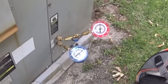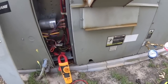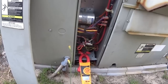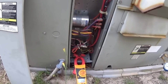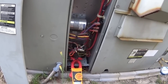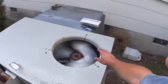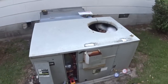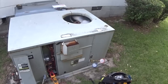About 215 over 75. So the refrigerant charge is fine. We've got 13.6 amps. While running, capacitors checked good without a load anyway. We're not doing too shabby, I suppose. Got pretty good heat coming off of the condenser fan. Let me see if I've got a compressor kit and we'll go from there.